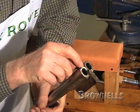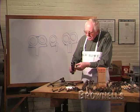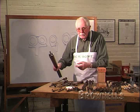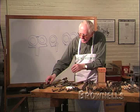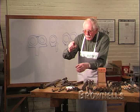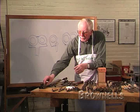So this is a long way from finishing. You'll find that if you look in these and pass them around, you'll see that right in the end there are some threads in these barrels — rough old threads. Those threads were put in there at the proof house in Birmingham because these barrels were provisionally proof tested before we even started on them. They put a rough old screw thread in there — it's a process called hotting because they screw what's called a hut in there, like a plug with a touch hole in it. They test these like an old black powder gun — they put black powder down the barrels, a massive load of shot, and then put the tubes in a bank of sand with little grooves cut in it to hold each tube. They have a little trail of black powder leading to every touch hole in the little hut or plug they screw in there.